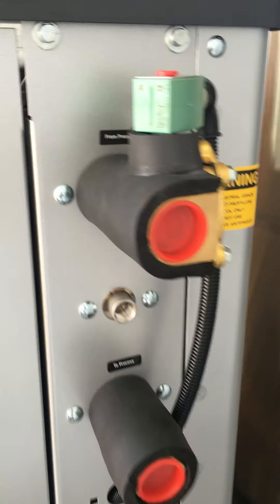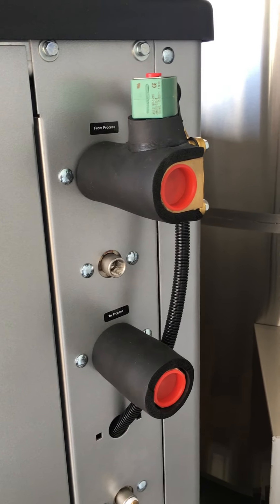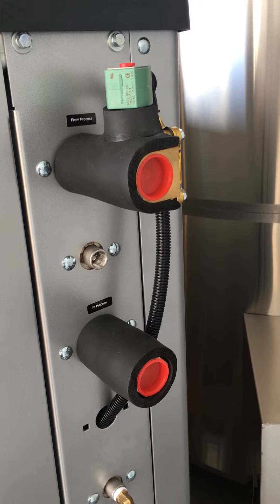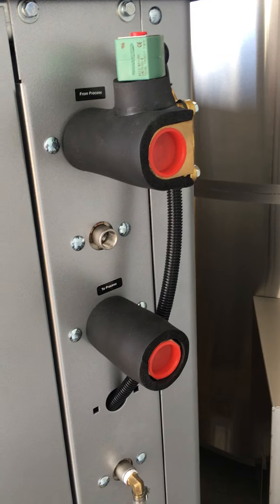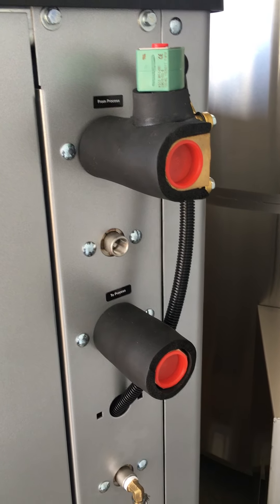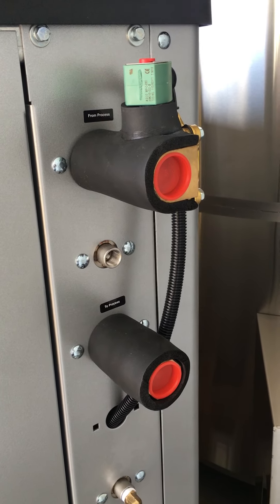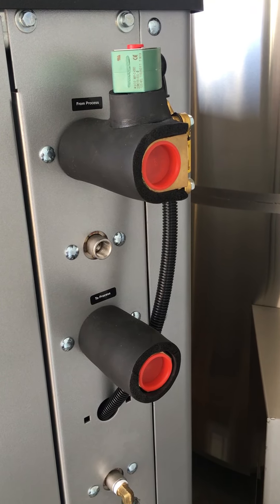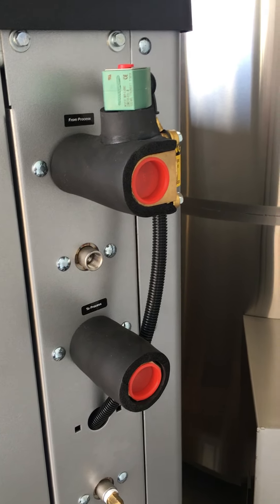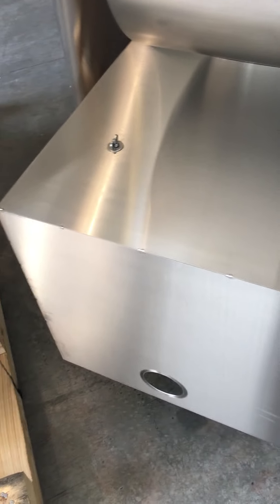This is the to and from, and the check valve below is to keep water or glycol from running out of your tanks if you need to shut off the unit to service it. The solenoid valve is secondary, acting on that, so these two valves operate with each other to make sure you don't get backflow.